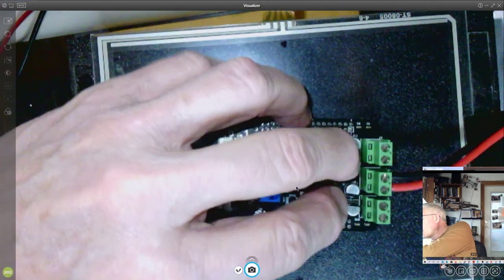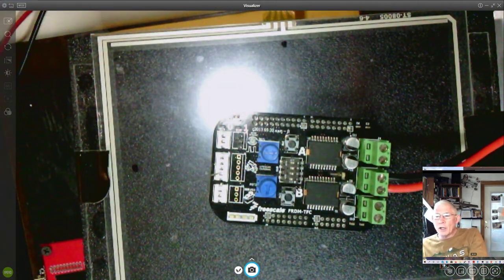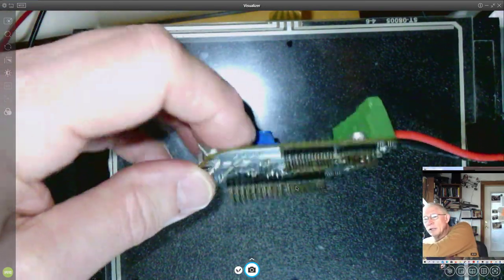These have a lot of solder. There's a big heat sink on the bottom of these chips, and they're soldered pretty solidly to the board. Besides just the pins for electrical connection, there's also the thermal connection, and so that helps dissipate the heat. These are able to dissipate the heat into the printed circuit board, and that's partly why there's no paint on here, to help have that heat dissipate.